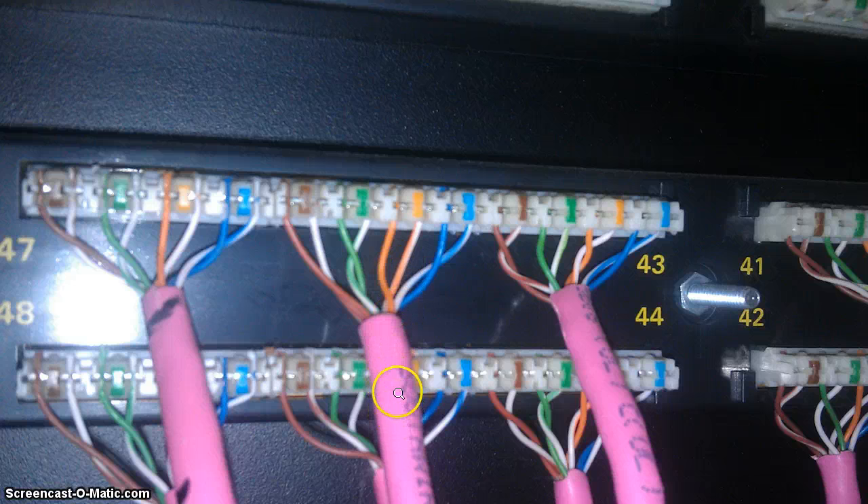The jacket being the skin of the cable. So there are some pretty decently terminated ones on a 110 patch panel. You could have maybe tightened those up even a little bit more. The reason this is important is because not only does this help with signal preservation in terms of the speed, but also the twists that are in the cable should be left as much intact as possible before they end up on the terminals.